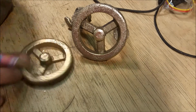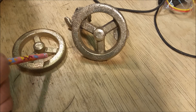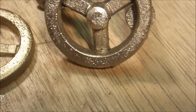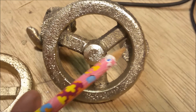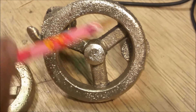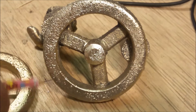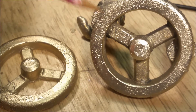Just to go over what we see here — this is the first casting, this is number two. Definitely fixed. There's a shortage here. When I had put them together, I don't think they matched up perfectly. But the new cope and drag have pins, so they matched up, and I definitely got more definition here. As far as the pitting, I can't say I noticed a whole lot of difference — roughly the same, maybe even a tad bit worse on the pitting. Looking at Myford Boy and Petro Bond brass casting and a couple other comments on YouTube, I went ahead and ordered 10 pounds of Petro Bond, which is supposed to give me a better finish with less pitting. So that's on order — it won't come in until next week. But this is casting number two.